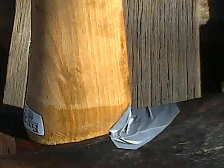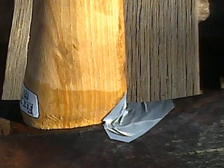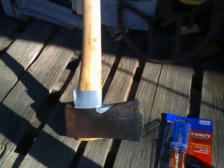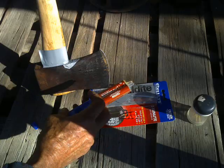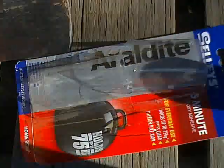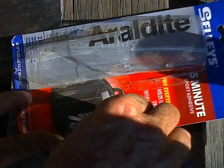However, I can now apply a bit of epoxy to that and it's going to be a whole lot geometrically stronger than if that box wedge was not there. So I'm beginning by putting a bit of duct tape to cover the bottom hole in order to prevent the epoxy from running straight down through the axe head when I mix it up and stick it down into the head, because it will have a great tendency to run down there into the groove.